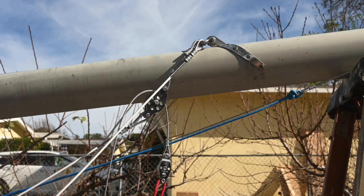The jib halyard and forestay on the early boats is a lot like the Hobie 16. When you tension the jib, the halyard basically becomes the forestay, and the forestay goes slack. The Hobie 16 forestay is actually a little bit too long because they rake the mast back pretty severely. It's about 6 inches too long. So you need one that's about 17 feet instead of 17 feet, 6 inches. And just about anybody who makes rigging can make that for you.